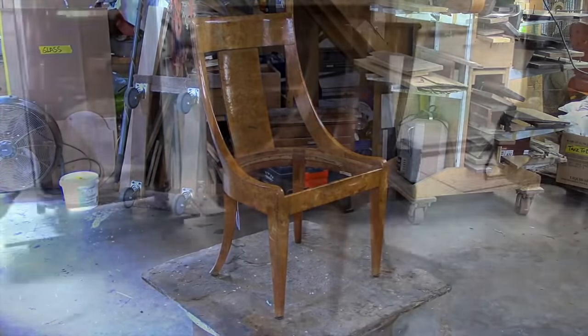Okay, so now this will be my first attempt at cutting this knuckle joint here. As I was looking at this, I realized there's a bevel cut here that actually serves as the stop where the other leg meets it. So the first thing I'm going to do, I believe it's identical to this one. It almost has to be. I'm going to measure back and make that little 45. Yeah, I think that cut looks just about right.